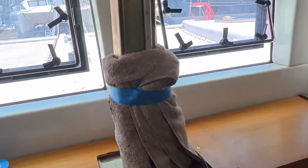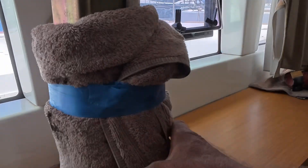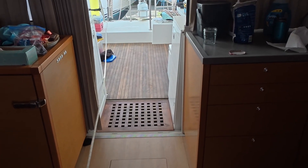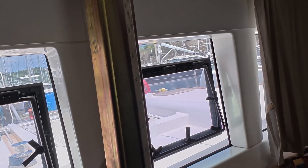So what we did: we cut with the side cutter and then attached the rope here on the gusset. We put a towel here just to protect if it popped. Then we passed it through the hole on the bottom and all the way back on the back of the davit and then to the winch. With pressure on and a lot of hammering, it just popped. All good.